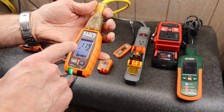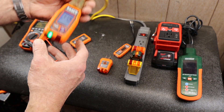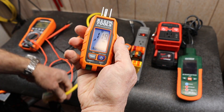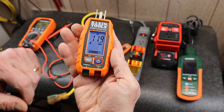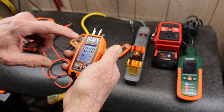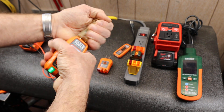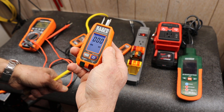Then in bold letters it says 'correct' if everything is there. The voltage AC coming out of here it's registering as 119, and it's indicating it's a live circuit. What's neat is sometimes you can't quite see it — let's say it was wedged down — but when you pull it out it actually holds the values. You can see it's blinking now, giving a 10-second warning before the reading disappears. There's a little 'H' that pops up meaning it's on hold with the values stored. You can also just hit the reset button to clear it and do another test.